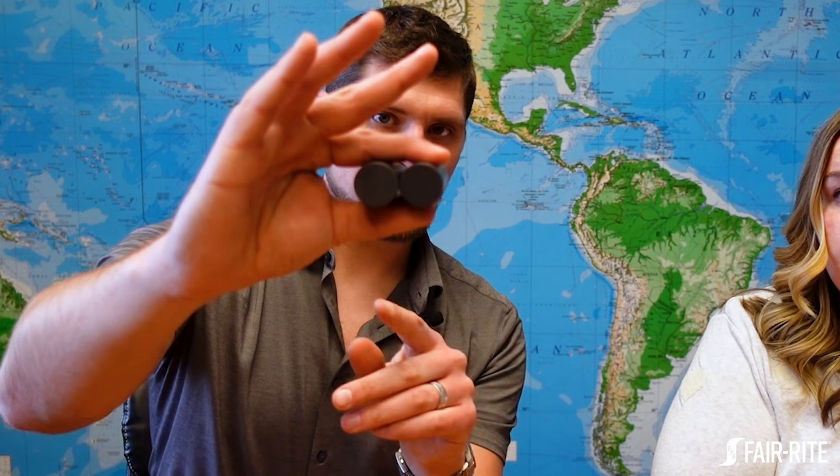You could also stack rods side by side — that doubles your cross-sectional area. The downside is that you wind up with an air gap top and bottom where you don't have rod material, which reduces coupling somewhat from the winding into the ferrite core. It's not going to be as good as a solid slug shape. Now if you made this out of, say, a hundred much thinner rods to get the same equivalent diameter, you'd get something a lot more cylindrical, so there's probably less of an electrical disadvantage — but it would also be kind of horrible to put together.